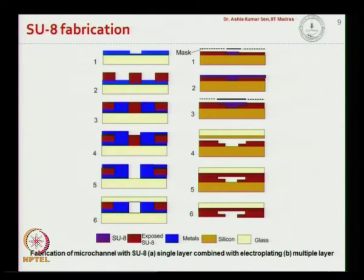Here we see the fabrication process using photoresist as a structural layer with a glass substrate coated with some metal layer. We put photoresist here, then further metallize to fill the cavity with metal, then metallize and pattern again. We remove metal from selected areas by selective etching, and then in the fifth step remove the photoresist from that area.